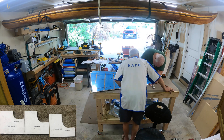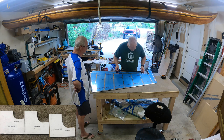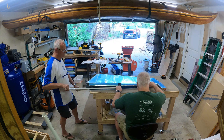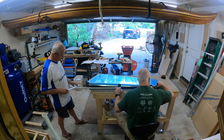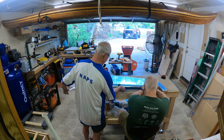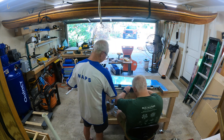Much better than just trying to use a piece of paper. We just continued to work back and forth until we got the templates to fit right. As we got down near the base of the rudder, I found that one-inch PVC worked better for the bottom section, while three-quarter inch near the top gave better results as we worked to roll that skin up.